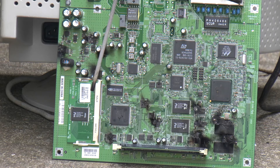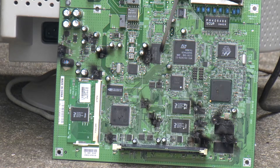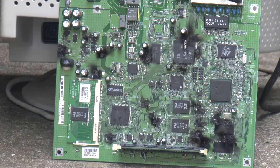U21 is a Samsung K4S161622H, 2MB SDRAM — that's up here. It's connected straight to U22, which is an STMTC20156TQC1, a DMT modem, ATM framer and controller. U23 is a Sipex SP3243ECA RS232 interface, which connects to the console port — and it's here.